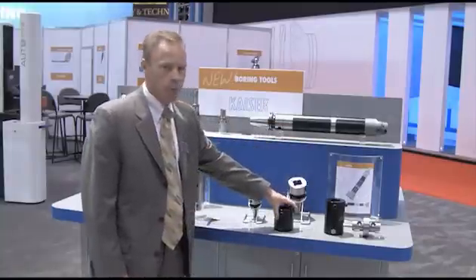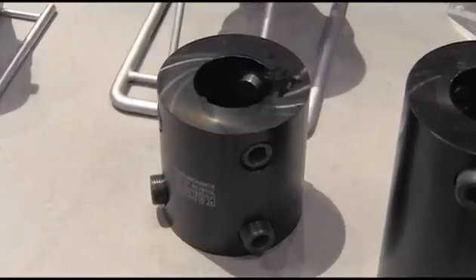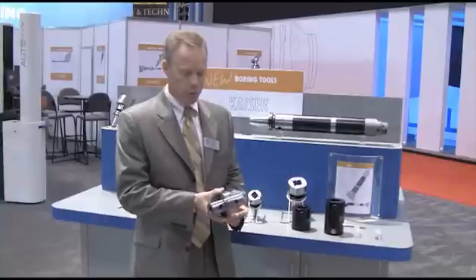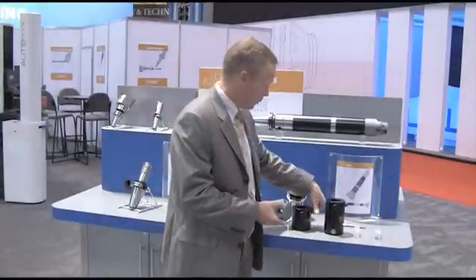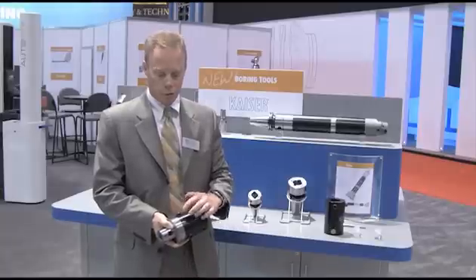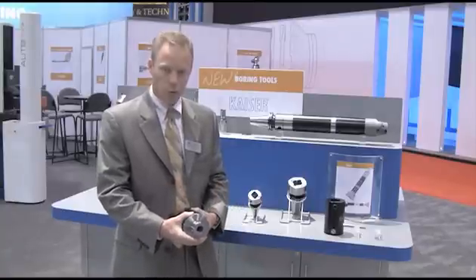The tool connection was developed so that the aluminum tools would not have any male connection to them whatsoever. Here we have an aluminum extension which is completely female in both directions. All the transmission of radial torque is taken up by a receiver made out of steel and a double-ended pilot male connection. To put this tool together, simply insert it into the female on one side, locking it in place with three coupling screws which handle the torque transmission, and to attach another tool to this side, we would use another female-to-male coupler and join them together.